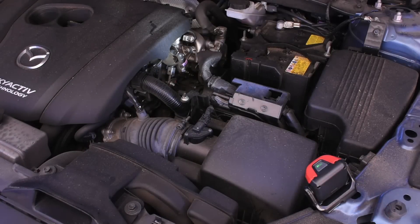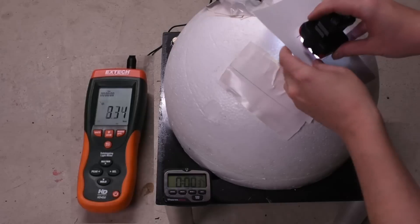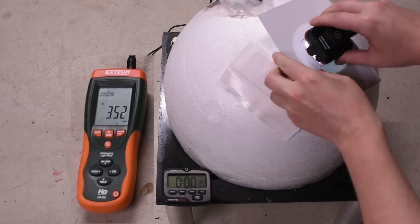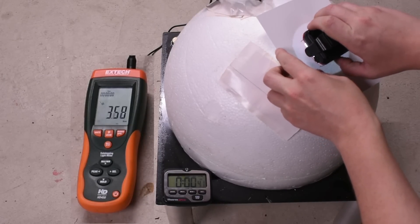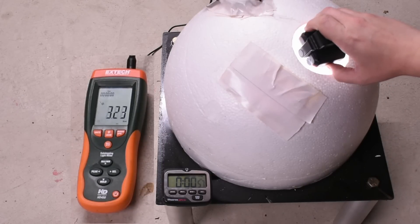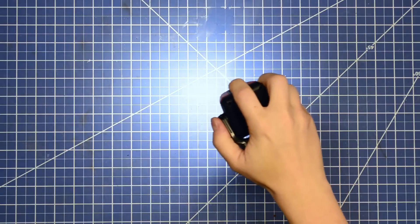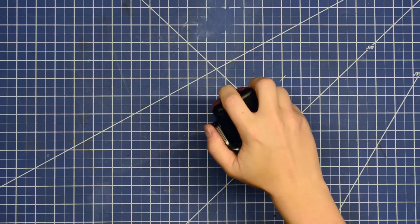In the globe of lumen truth, waiting 30 seconds per the ANSI FL1 standard, we're seeing 356, 362, 364 — and low is 162 to 180 or so. The 90-CRI mode is spot on at 300, maybe even 320. With the white card removed, high mode is still seeing about 366. We'll call that 365, or 9% off their claim. Not criminal, but maybe a rocky start.